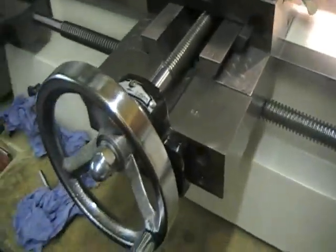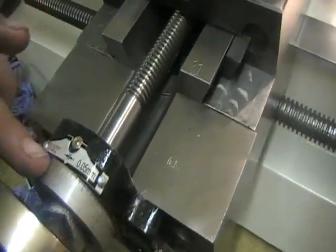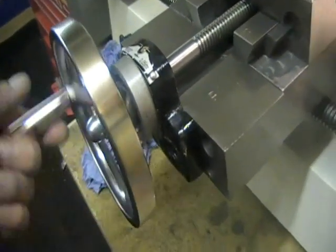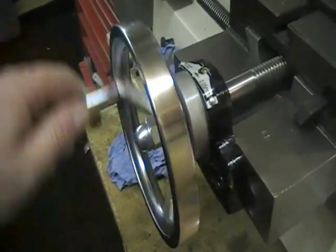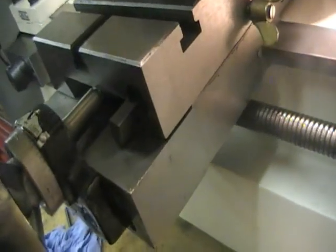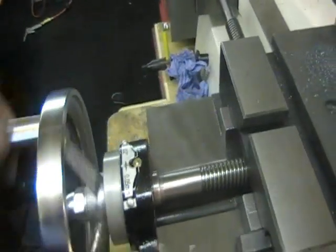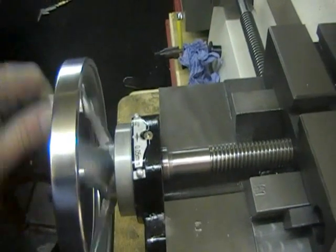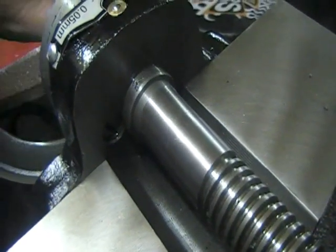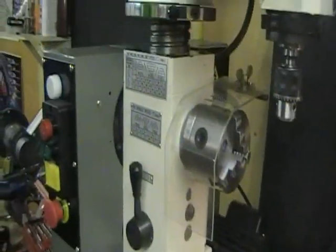That's it, it's back together. I've greased it all up and it's a lot smoother now — instead of the back of this hub rubbing on the outer hub, it's gliding on that little bearing and it's got a much nicer feel. The sort of thing you'd get on a top end lathe. These lathes are good for the money and little modifications like this all help. You can see the hole at the back — the little grub screw's in there and I've just lightly nipped it up. And that's it — this is Eid1B signing off.